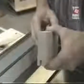The next thing that I want to do is make a groove in all 4 pieces for the plywood panel. The groove is slightly offset, and I've adjusted the fence so that the bead will be facing out as I run the pieces through. And I'm going to install a feather board.